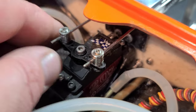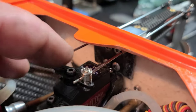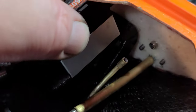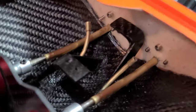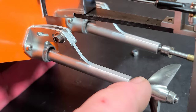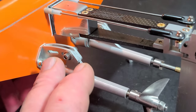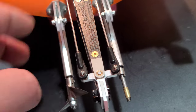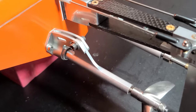Running a DS servo. I had to put a couple of washers under the connectors to line up with the through-hole, but it worked out perfectly. The servo mount is really low profile to fit in the boat with room for water pickups. The stingers are low-profile 80mm units from Dr. Jet, bored for 4mm flex cable, and they're spaced 50mm apart so I can run a 45mm prop on each side with a few millimeters to spare.